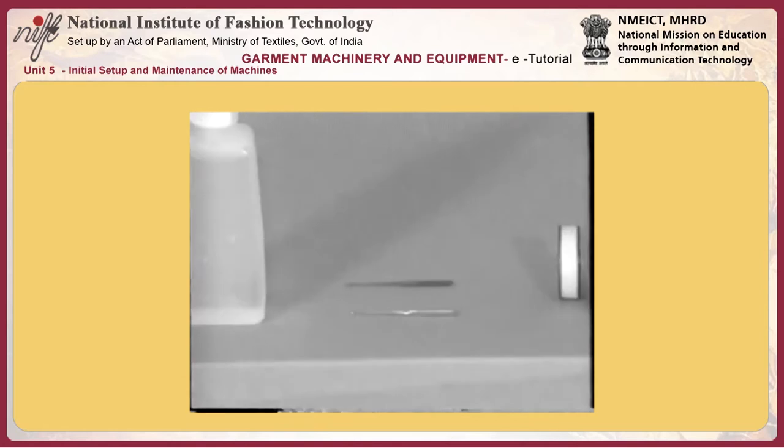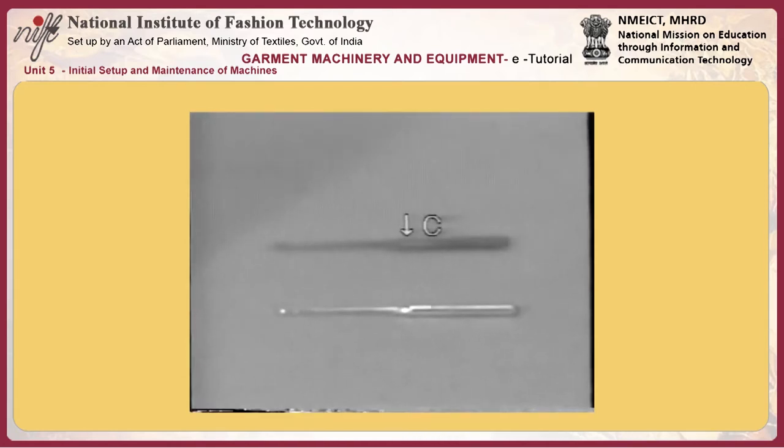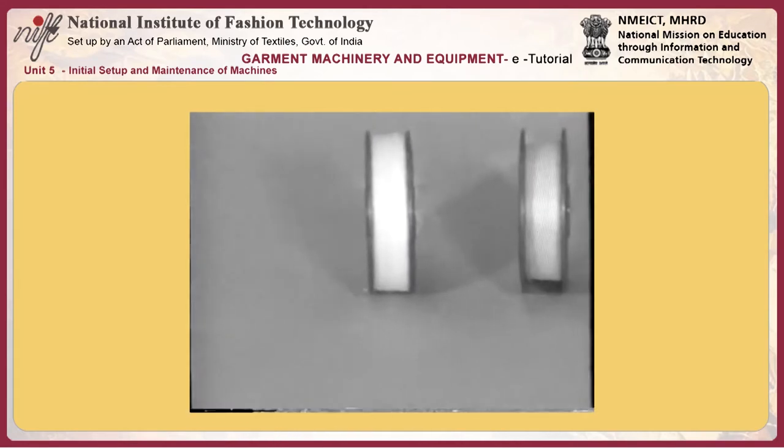If the bobbin thread tension is insufficient, the needle thread tension will also decrease correspondingly. As a result, the needle thread stitch will be made on the wrong side of the material to cause double tucking, resulting in thread breakage and thread slip-off.